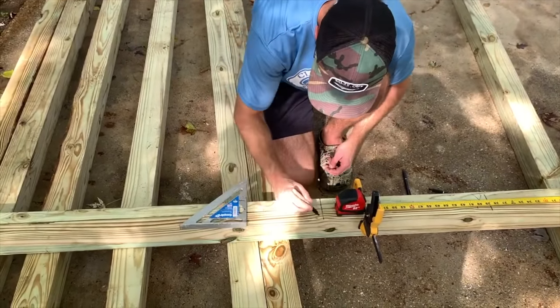Then I'm gonna dry fit everything and make my cuts, just as before. I'll link all of the specific PVC fittings I'm using in the description. And after dry fitting everything in place, you're gonna glue all the PVC components together with the PVC cement. And because this is a high visibility area, I wiped off any excess PVC cement purely for aesthetics.